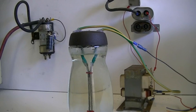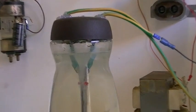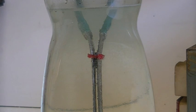I'm going to change that cap over to a 1 µF cap and come back and have another look at it. The cap sitting on top of the original one now is a 1.08 µF. Going to plug that in and have a look at our gas production once again — there's no measurements going on here at the moment, that'll be later on down the track. First we just want to get the effect happening. It does appear to be marginally better. I don't really like fiddling around with these caps without discharging them. Let's disconnect our shorting circuit again and have one last look without it.